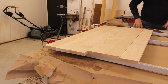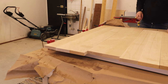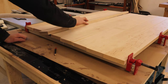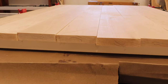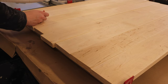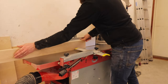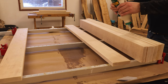Now, with all the boards milled down, it was time to do some glue-ups. Luckily, on this project there were only two needed. On the first glue-up I made two separate panels. I like to alternate the grain pattern to counter for seasonal movement to have more flat panels. And the second thing, to have more flat panels out of the glue-up, I like to mark all the joints with I's and O's and then run the boards one final time through the jointer — I's facing inside the fence and O's outside. This is to counter that if my boards are played or the fence on the jointer isn't exactly at 90 degrees, the edges on the joints will complement each other.